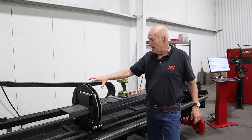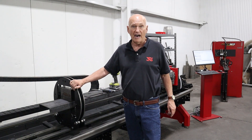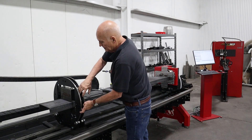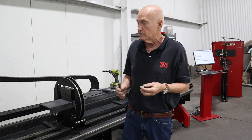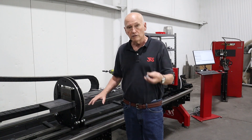The ring adapter itself has a bottom half and a top half. They are fastened together using two socket head cap screws — these are 16 millimeters, however you can also use a 5/8-inch. There's only about a five-thousandths-of-an-inch difference between the two sizes, so we made it so you could use either one.